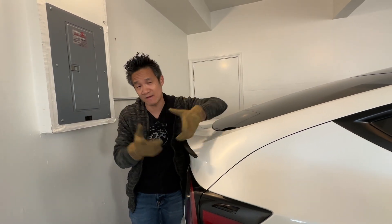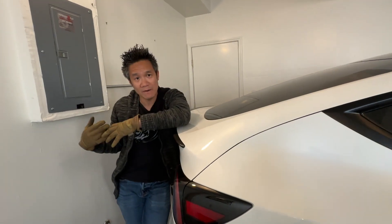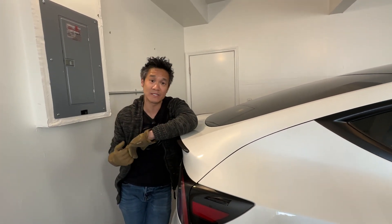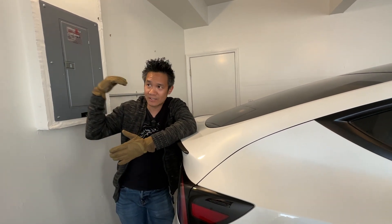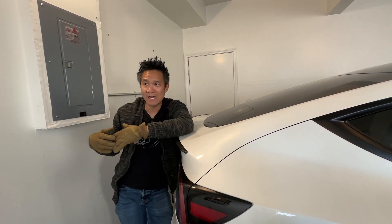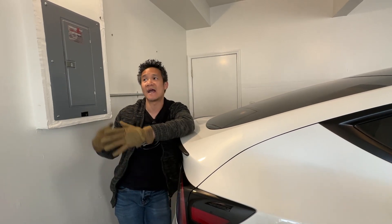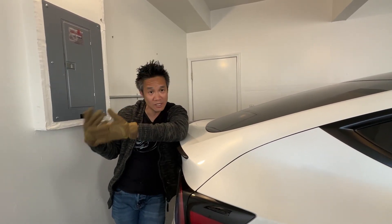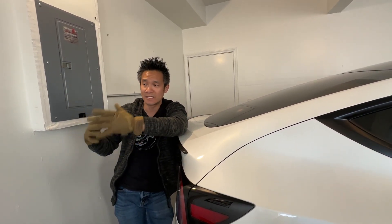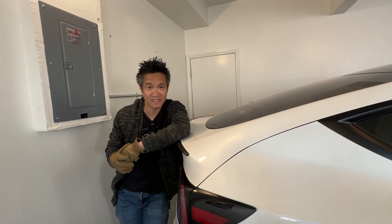Power arbitrage is very important. The battery will be used at night to charge up from the grid if the solar power isn't enough to charge the batteries already. We assume there's gonna be solar during the peak time of the day charging the battery, and as the sun goes down we'll continue to use the battery. Then at night we want to use grid power to top off those batteries, and during the day when the sun rises again we're still using that topped-off power from the battery, then continually charging it with the solar panels.